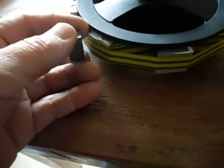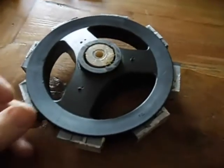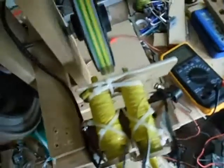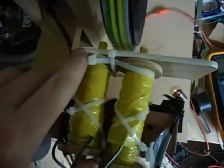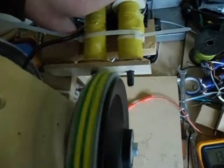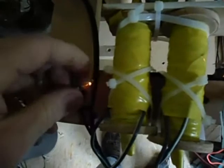I'm going to test it with one additional. Just finished the new config — eight magnets, just a little bigger. It's up to speed. 70 to 80 milliamps. At around 390 RPM. I'm going to shift it — that's one lamp on, very good. And the other one is also coming on. Speed is dropping a bit — it's not holding here.